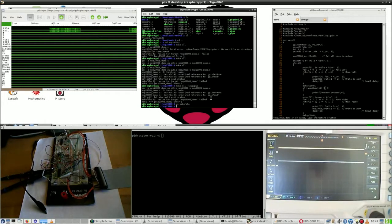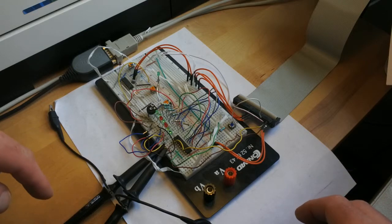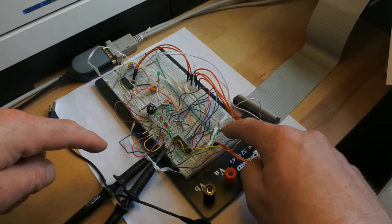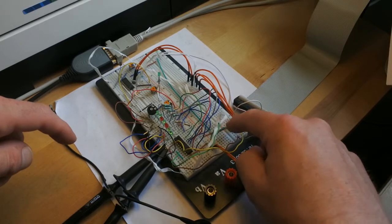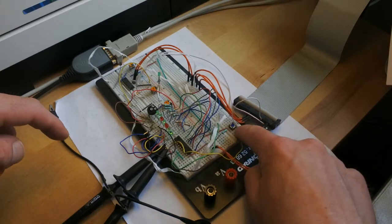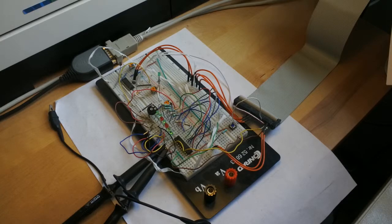So, new interesting adventure. So, the goodbye segment again. What did I do? Well, apart from fixing the wiring and using all the sudo commands to get the demo and Raspberry Pi version done, I've now added a brown wire from the button to the plus, then a resistor to connect the button to the ground, and a wire from the button to pin 12. And as you could see, I have to change something with the compilation in order to get it working. I didn't expect that, but it has to be.